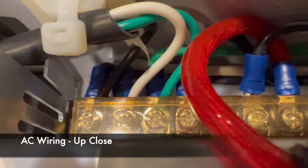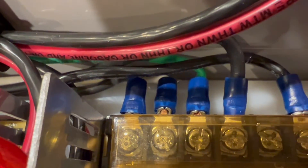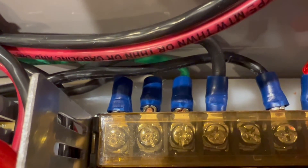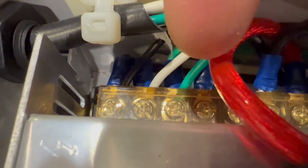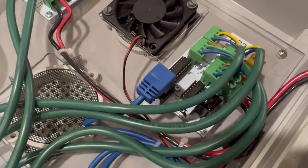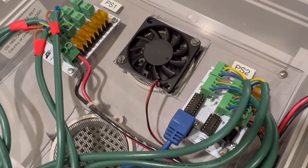Close-up view of the AC side. There's a white wire hiding behind on the middle — you can see a black wire, a white wire, and a green wire running across going up to Power Supply 1. On the DC side, there is one additional wire connecting the DC ground between Power Supply 1 and 2. There's a black wire right here that runs across and connects the DC ground between both power supplies. What that's doing is bonding the grounds on the DC side so that if you're using the differential receiver and outputting to two pixel strings with power injection, you'll have good ground continuity between both power supplies and won't get any data corruption.